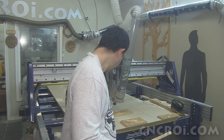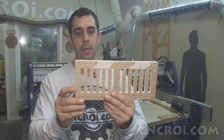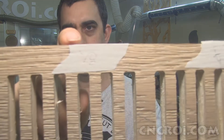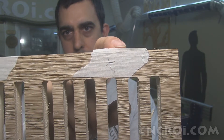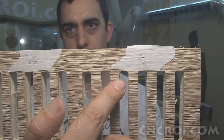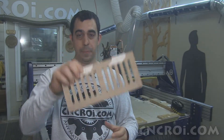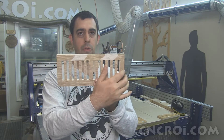The first step of doing this job, after the designing process was done, was to use our CNC router to cut it out. You'll notice that I have two pieces here — here is a 1/8th and here is a 1/4 inch. If you notice over here it's a little bit more square than over here. The reason for that is because here I used a 1/8th bit to do a secondary pass after I used a quarter inch to do all the holes.